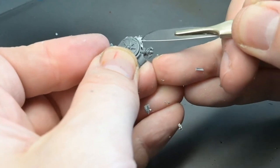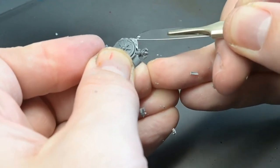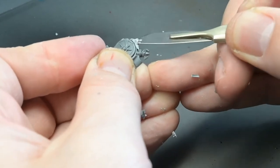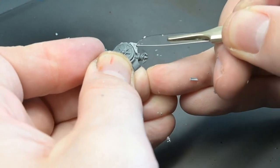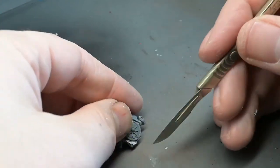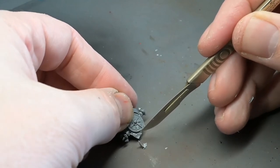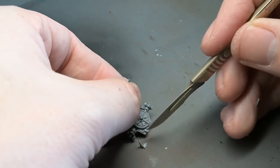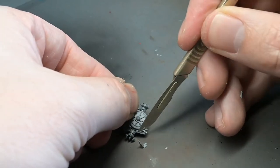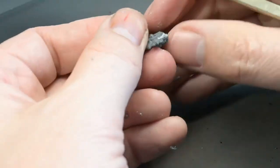And you can see the same again. I've got my fingers clamped together. I'm cutting actually away from myself that time, but I'm taking very, very small cuts, so that I'm not trying to take off too much and having to put too much pressure on there. And then once you've made all those little cuts, the parts just kind of flick away like this. And that's basically how we get this little recess and this little shelf done. We just keep attacking it with small little cuts.